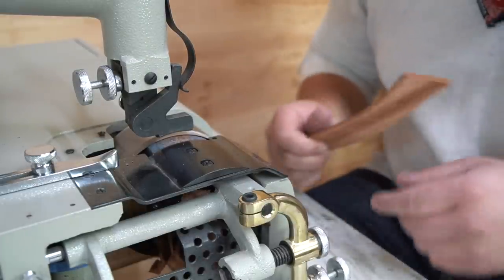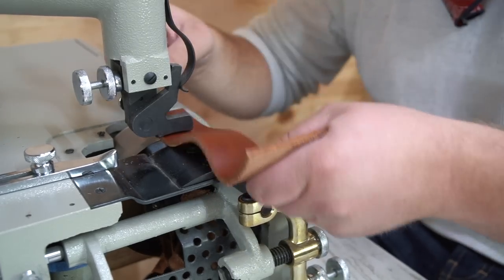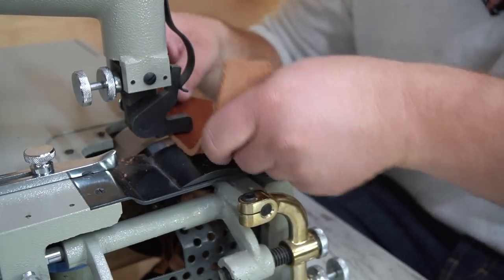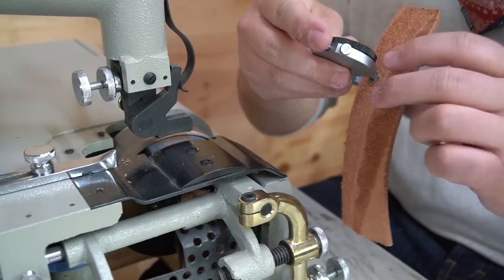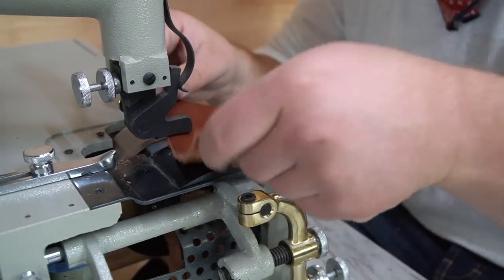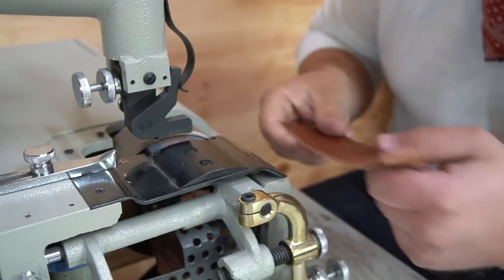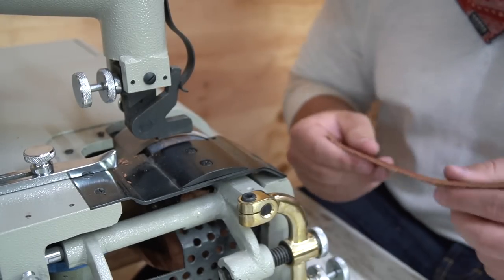I'm gonna push the stone a little bit closer to the blade so that it actually pulls it through, and drop it down just a hair. I'm dropping it way down. Let's see how it goes. We're down to 9. Down to 8. I'm gonna go way down here. There we go, that took us down to 6. So that's probably just one or two more steps away from getting us where we need it. That's step 5.5. That would probably be good for the base.